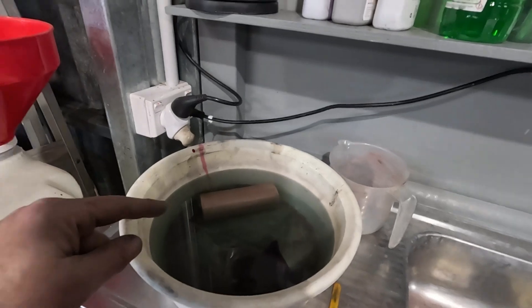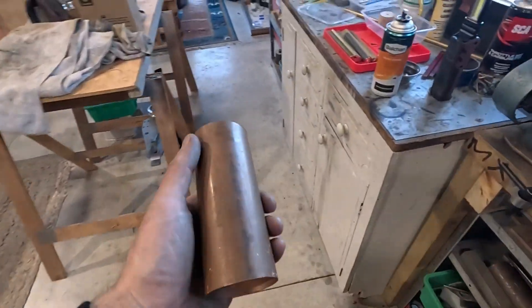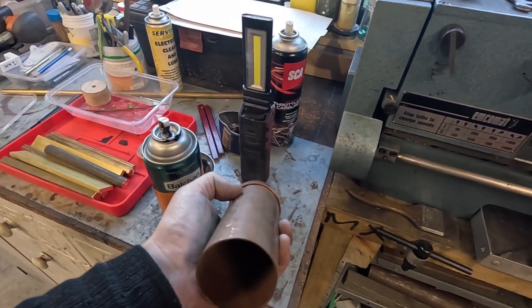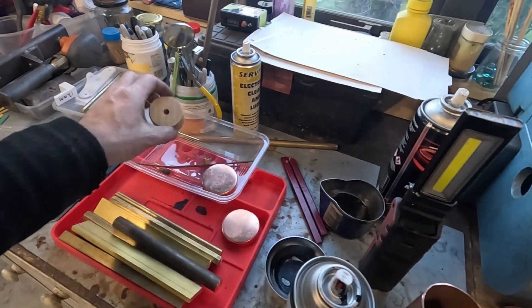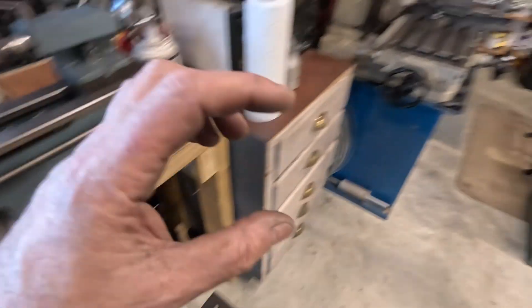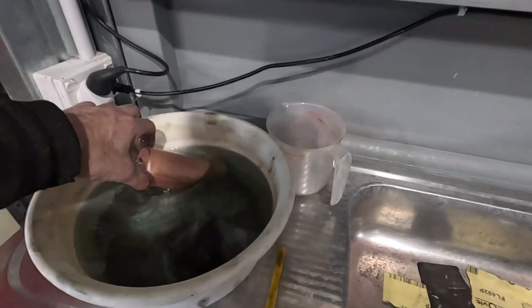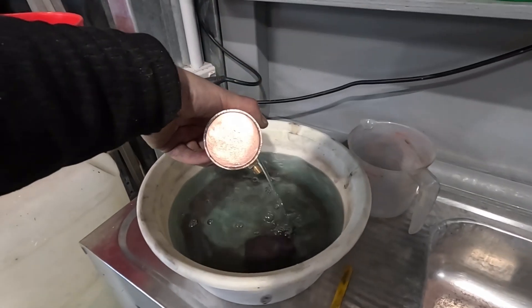This is actually my third attempt at the boiler. I'm using copper water pipe - 50 mil, two inch diameter copper pipe. I was initially looking at using end caps for the end of the boiler, but they don't fit right, they're too loose. I want the boiler to be silver soldered and you need much tighter clearances for that, and it also looks a bit crappy. So I did the trick where you cut a blank off copper and hammer it around a former - a hardwood former, a piece of ash - and make little end caps that press into the boiler. It's still sitting in its pickling solution and I've been slowly filing off the excess silver solder.